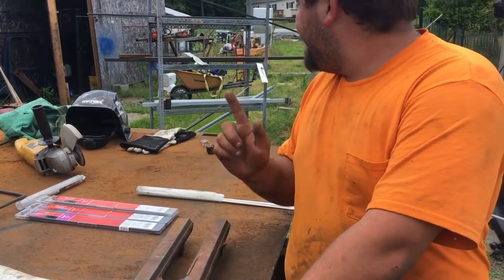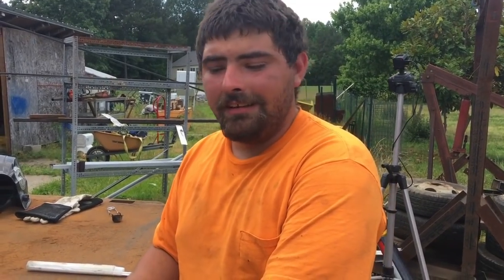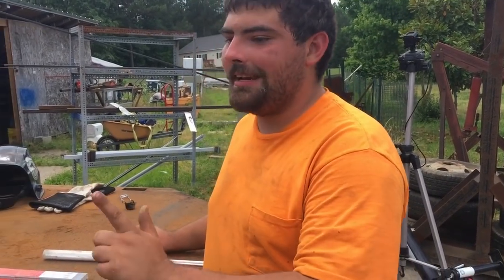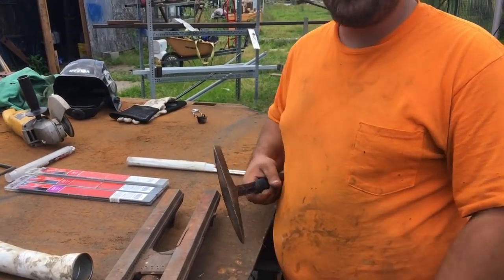Now, the best thing you can possibly do for post-heating, post-cooling is get a wheelbarrow or a bucket or whatever, fill it with sand. As soon as you're done welding it, and it's where you want it, don't grind it, peen it. You're going to peen it. Where's my chipping hammer? Thank you, sir. I appreciate it. You're going to peen it.